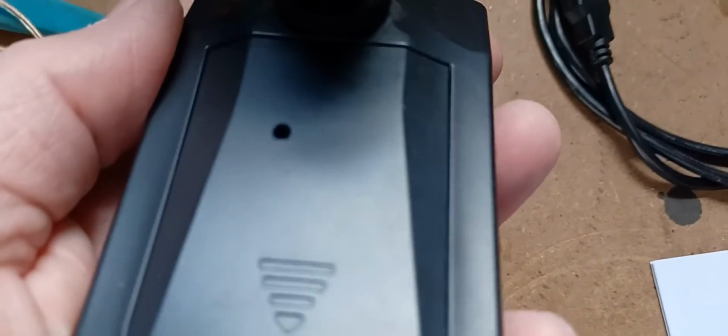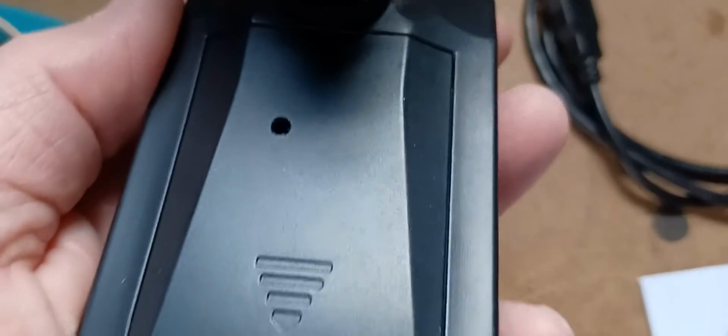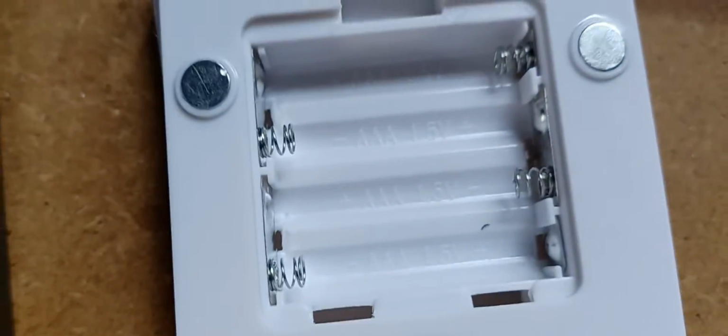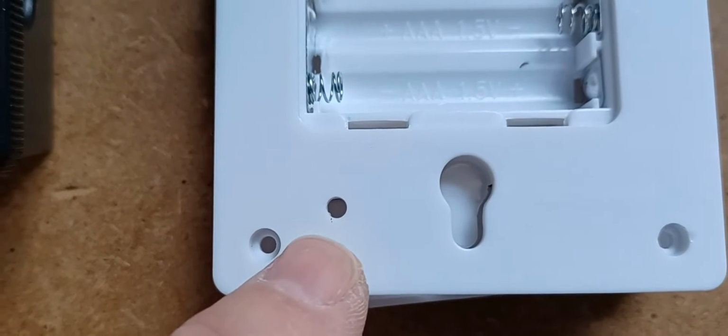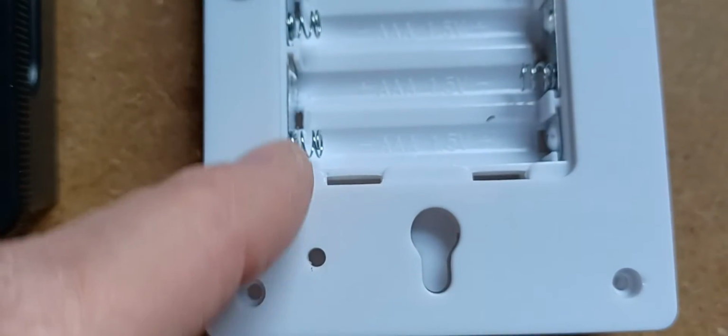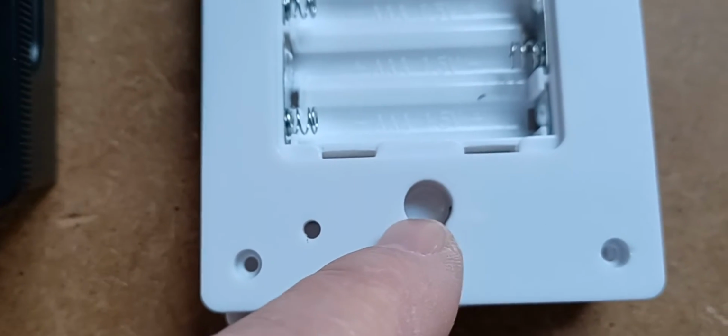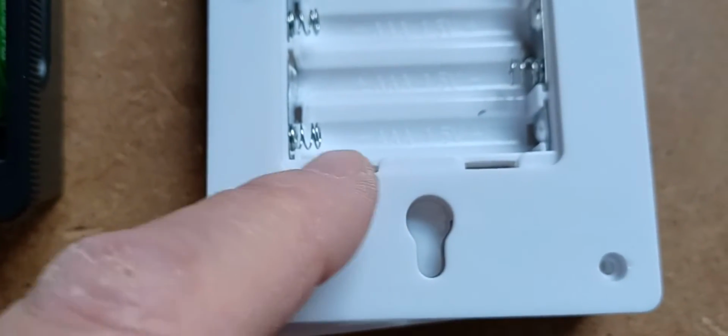See, that's the highest point. Nearly the highest point, where the wire won't bind up. So the knot will be underneath there with a little bit of slack inside, so there's no tension on the wire spot on the solder joint. And I'll bring it through here, and I'll estimate a little bit longer and make my knot so it pulls back, but there will be a little slack in there too.